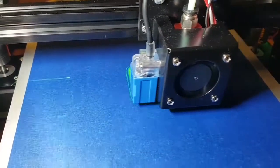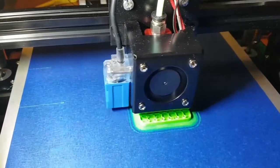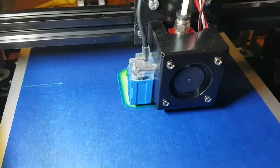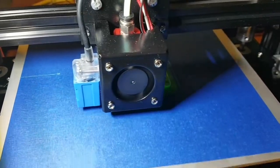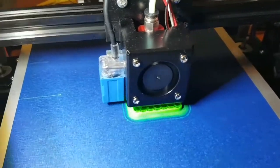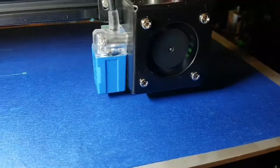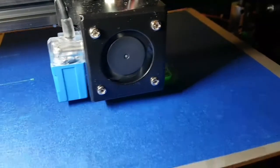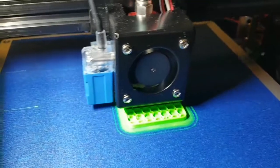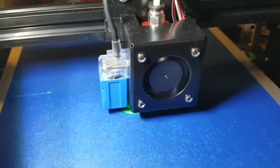We've finally got this thing working. The last one I did ended up all over the bloody bed — I'd forgotten to tighten the Y-axis stepper motor nut and cog, and that made a right mess. Having panicked about all sorts of things that could be wrong, I realized that the actual belt was slipping on the cog. And now it's perfect.